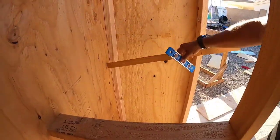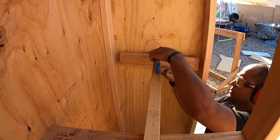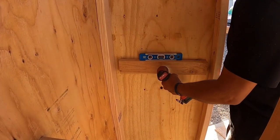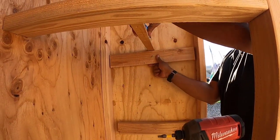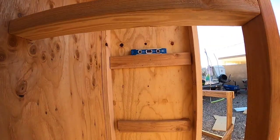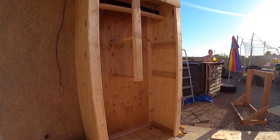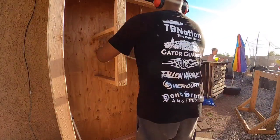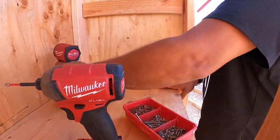We'll leave the bottom section open for a trash can, cooler, or vacuum pipes. To accomplish this we floated a stud from the top, screwed it in to the bottom to make an equally level piece of 2x4, then positioned the second shelf above it using a simple level to make sure we're even on both sides. Once that was done we took the remaining plywood sheets and cut them to fit the shelves.